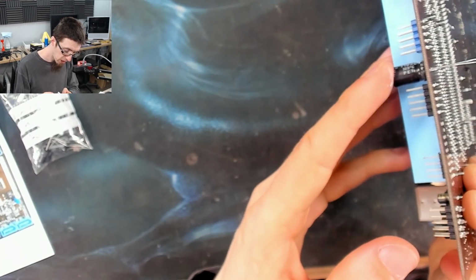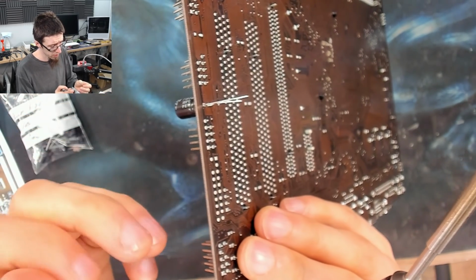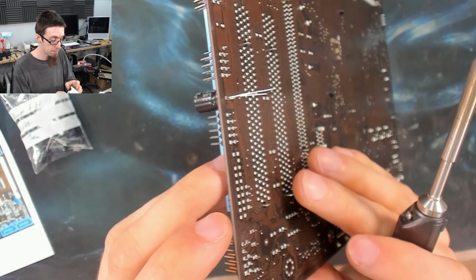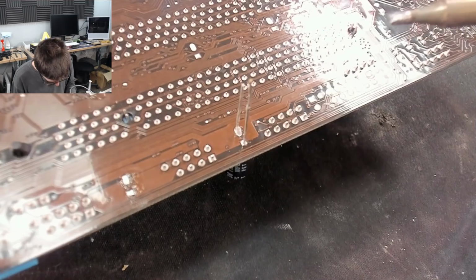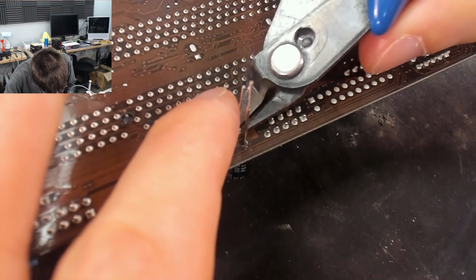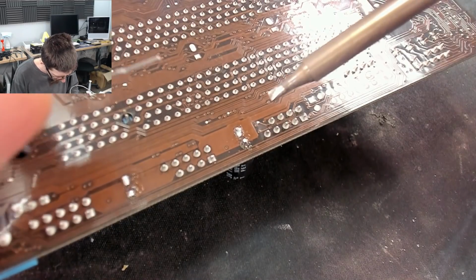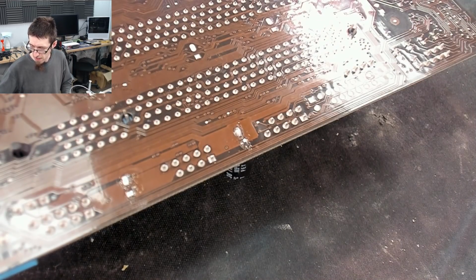That's gone loose where I've pushed all the solder through the hole. So that's very loose. What I'll do is I'll get all the capacitors in and then I'll go through, reflow all of the tips of the legs, then cut them short again. So just for the sake of the demonstration, let's do that on this one, and then we can go into fast forward because again there's 16 of these to do. So we've got that in place. So now I'll flow some fresh solder into that. That joint's gone a little bit frosty. It's because there's still some old solder mixed in there.